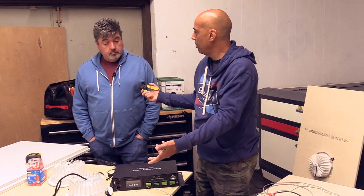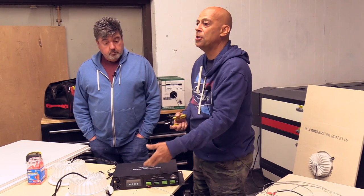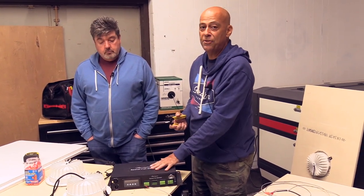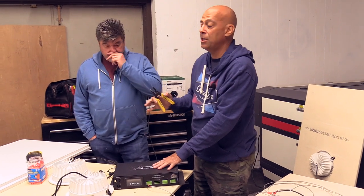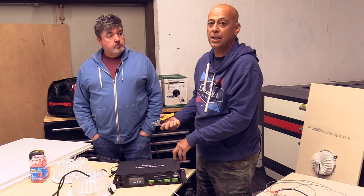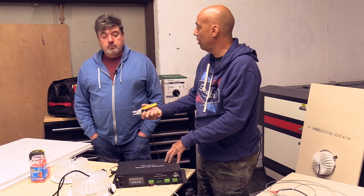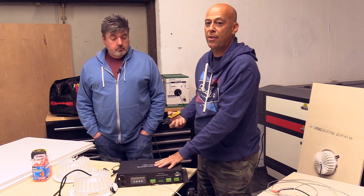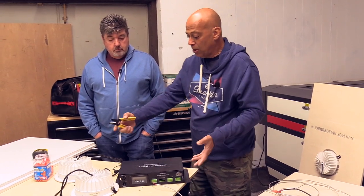You mentioned earlier, if you set it up as RGBW for the warm white, you have to run it as a five channel. Channel five being your dimmer and four zones of warm white. You have to run it as RGBW for the color, which is always a five channel DMX. Handle zones for that with different units.